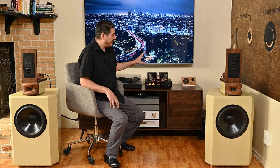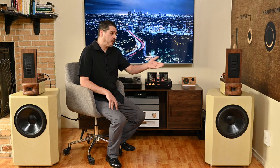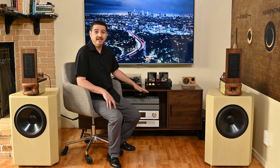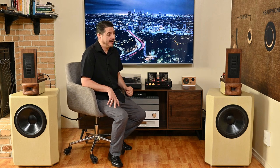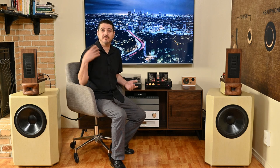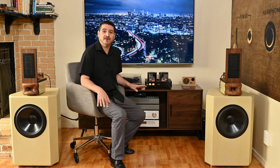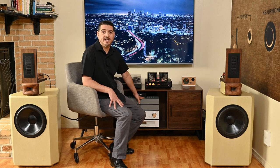As for the cons: the bass control really isn't there for me — I'd like better controlled bass. I found it didn't do great with a ribbon tweeter and felt a little harsh on the upper frequencies, though that wasn't an issue with soft-dome tweeters. And then there's noise. With the IOTA-VX, even running both units in mono with a planar magnetic and ribbon super tweeter, I get literally zero noise. When I had the Dayton Audio plugged in, in the daytime with regular ambiance around the house you can't really pick it up, but as soon as it gets quiet at night you can definitely hear static in the speakers.